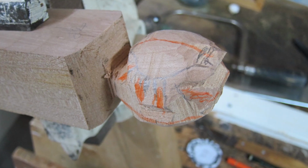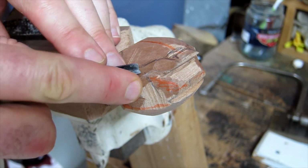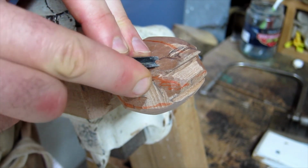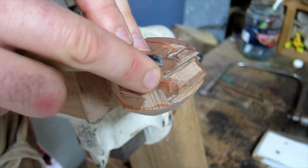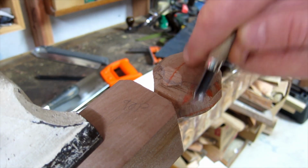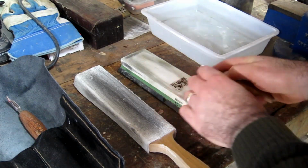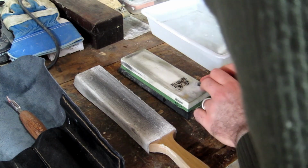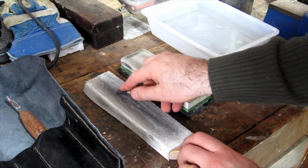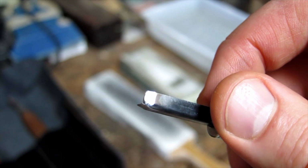Once you have the rough form, draw the details of your design onto the wood. Use a different colour pencil to again mark the high points to avoid removing them. The fine details can be carved with small woodcut printing chisels, including a flat blade, a curved gouge, a V-shape, and an angled blade. It is important that these tools are very sharp. Sharpening tools involves a sharpening stone or a piece of fine wet and dry sandpaper, and a leather strop with polishing compound. This will need a whole other tutorial to cover the process in more detail.